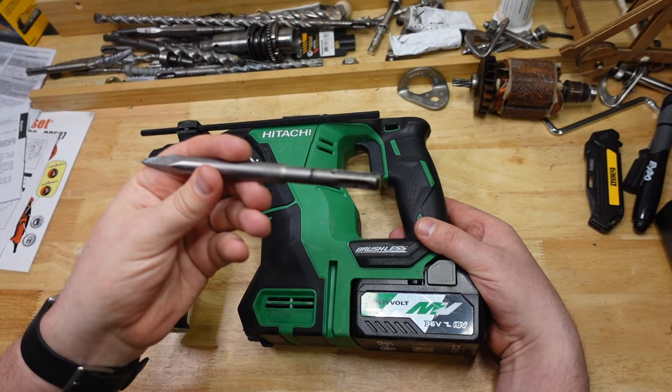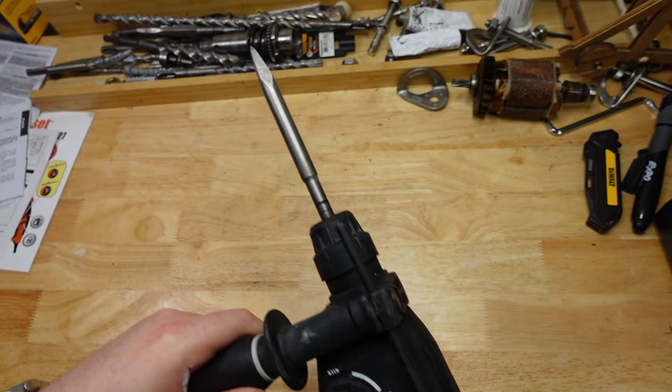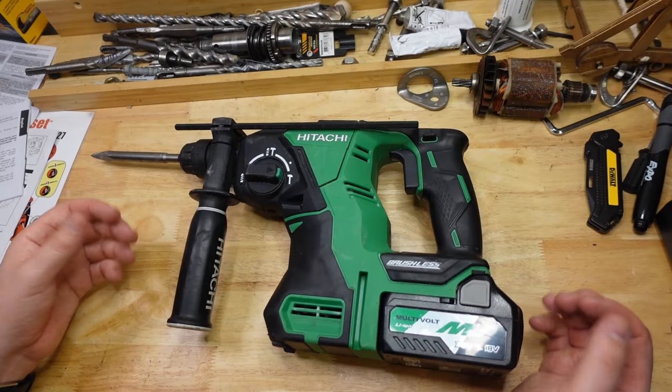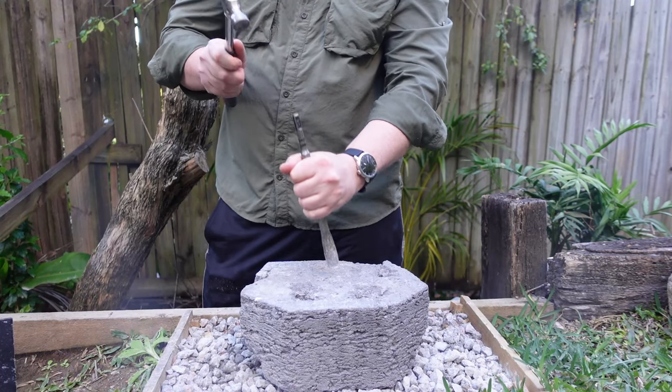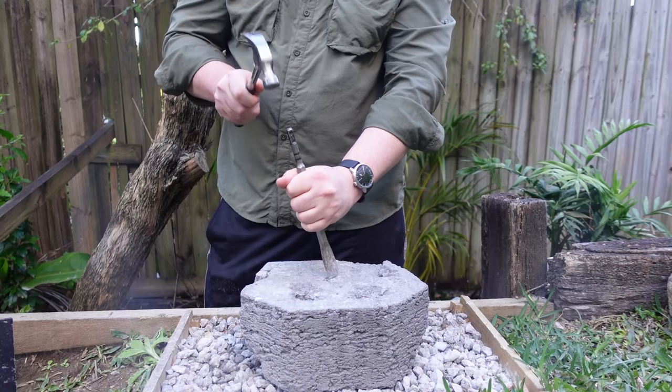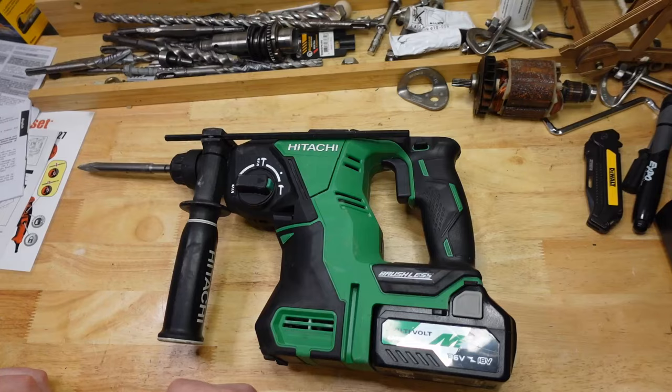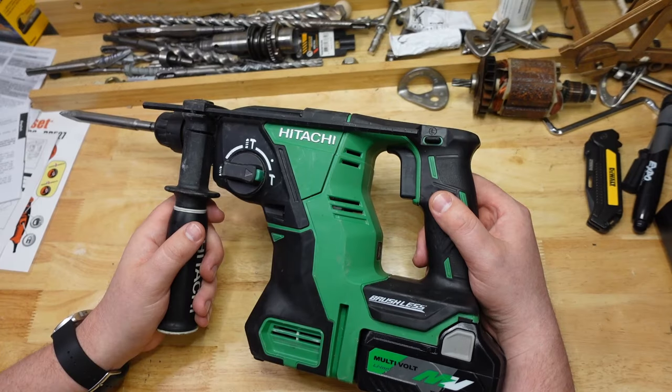You can see it's not really moving — so what gives? Well, basically when you're chiseling something you don't just hold the hammer floating; you actually hold it against the material and then hit it, and that's pretty much what rotary hammers do too. I did a bit of chiseling earlier today so we can take a look at some high-speed footage and see what's really going on.